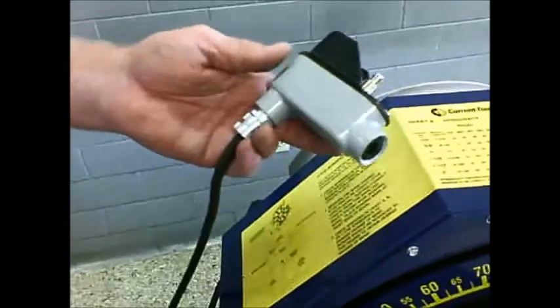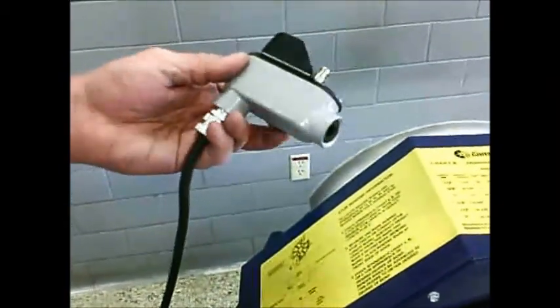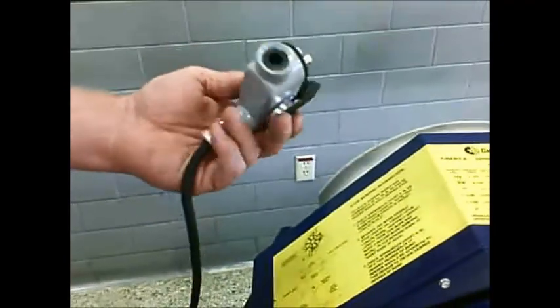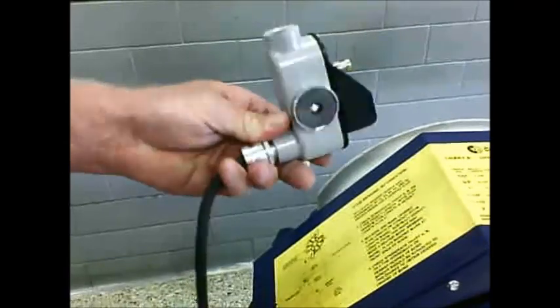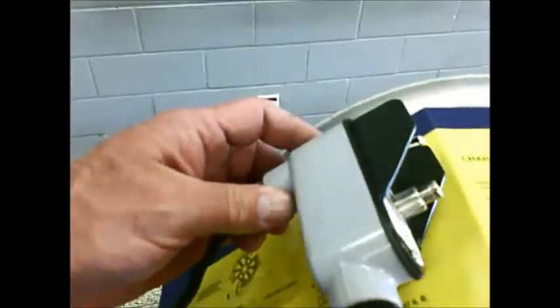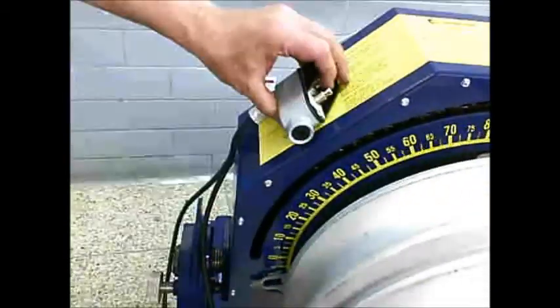You'll notice that we have a very simple pendant. This is an LB that every contractor has these laying around the job site if they have a problem or break one, easy to fix. In addition to that, we have installed a magnet so that unit will attach to any metal part of the bender when it's not in use.